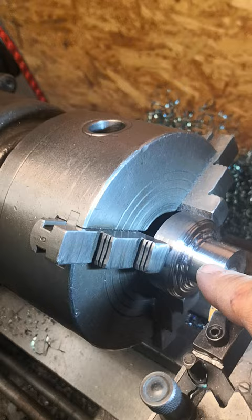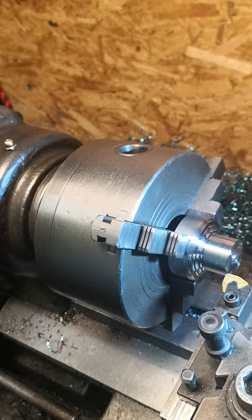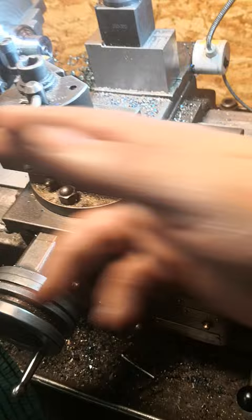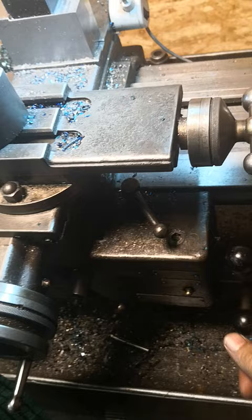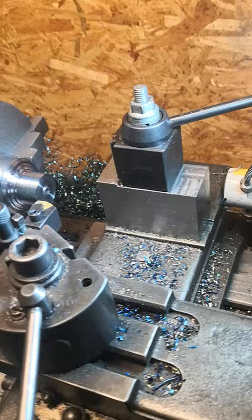I have some steps inside there that get turned out later — I had to adjust the auto feed stop. What you have to do is start the machine, then pull slowly down this lever until the half nut locks into the lead spindle, and then you watch the machine travel forward in the left direction. When it is not traveling in the left direction, you have to take the sleeve up — then the direction changes to the right direction.